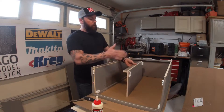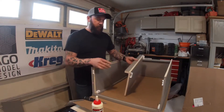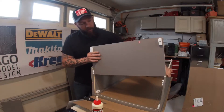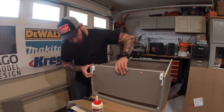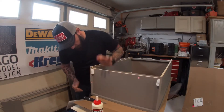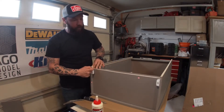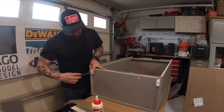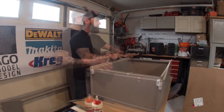Once your side panels are up, look for part D, which goes near the bottom and top of the cabinet. I went ahead and put some glue on the face frame. Slide this panel in from the top, and when you hit the bracket, gently flare it open a little so the cabinet piece can get into the bracket. Make sure you're in the gap and not sticking out, as that variance will make it difficult to slide the back panel in. Give it a half turn with your Phillips screwdriver to lock it in place.